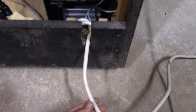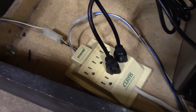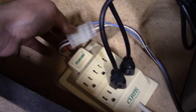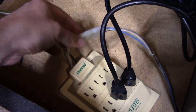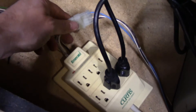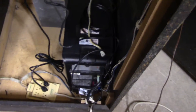Time for a tour. We have our main power supply going to our power strip, which is now connected to the marquee lights. I've put the harness on the lights and the power switch from the old power supply, soldered into this unit. The power switch just goes up to the side of the cabinet, and when we flick it, it turns on our computer, our monitor, and also our lights which run up to the marquee.